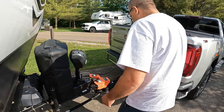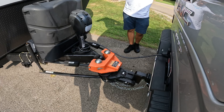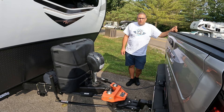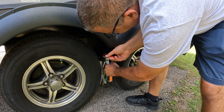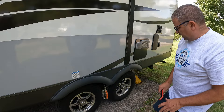We're level left and right, so we're gonna get our cross chocks in and put them in on left and right side on the wheels. So the first steps after it's leveled left to right: we put our cross chocks in. I'm just gonna put this in between the tires here and crank this out. I don't tighten these terribly tight, just like so, and that'll keep those wheels in place.